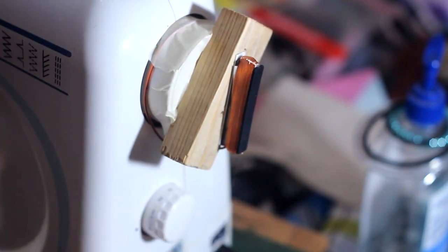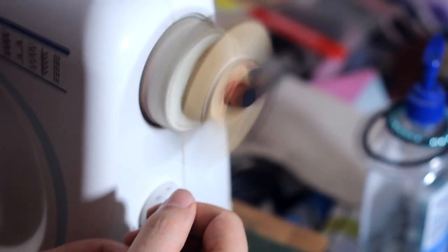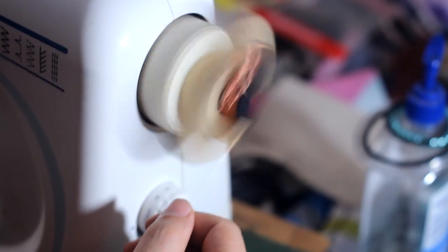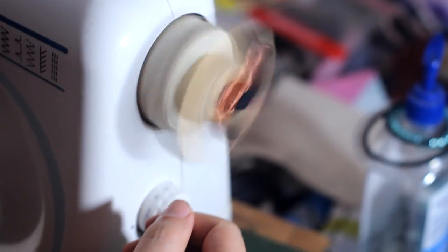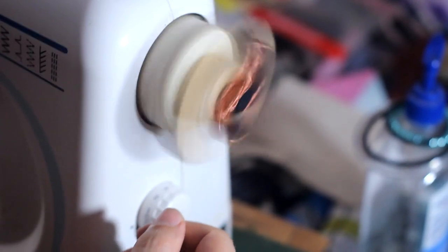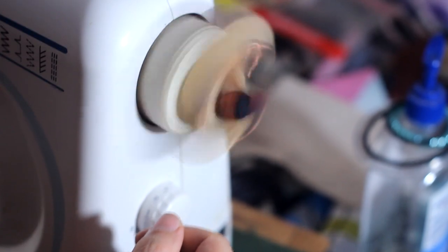With such a strong magnet, it would be my idea to go down a little in wind. I tend to try to underwind neodymium because of the strength of field. But for whatever reason, neodymium seems to make a lot of bass response. You'll see this pickup's not bright at all. And with as low of a wind count as it has, you would figure it would be super bright. And Alnico versus ceramic would also make you think, well, stronger is brighter.